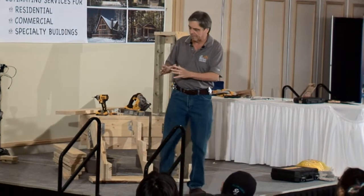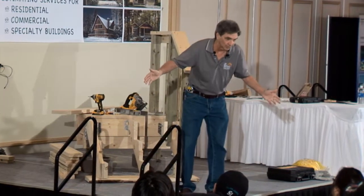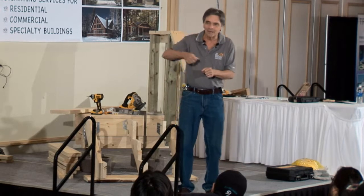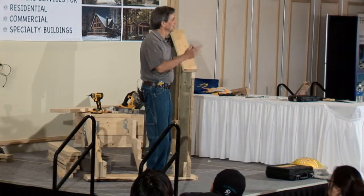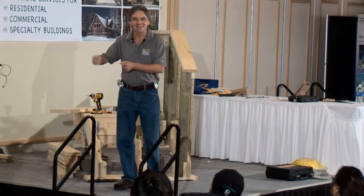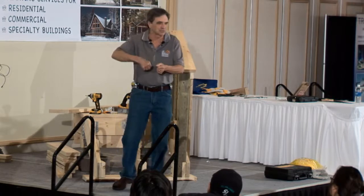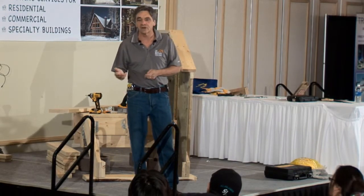We're going to have a little box with water, because this is a hotel. Look, we can't make the rug all green. Okay, so water and a paintbrush. And your part of the judging is going to be, do you actually put the end-cut treatment when you cut a board? And make sure that it's all treated. So you just do a little water treatment on there. We need to drive that home because it's so easy to forget when you're actually building.